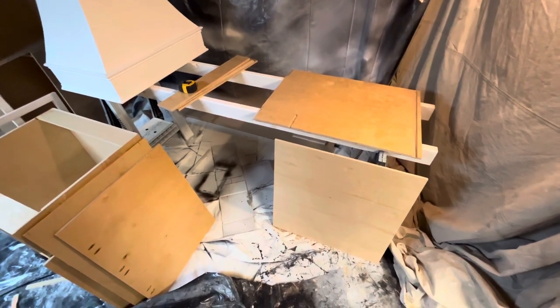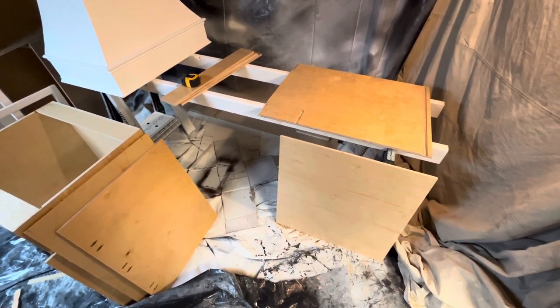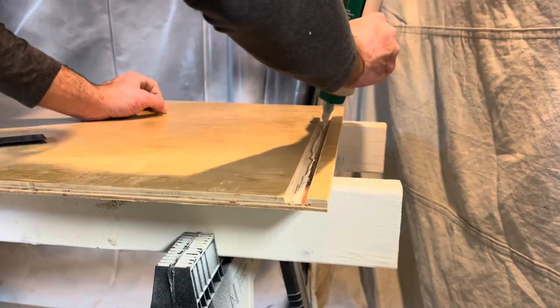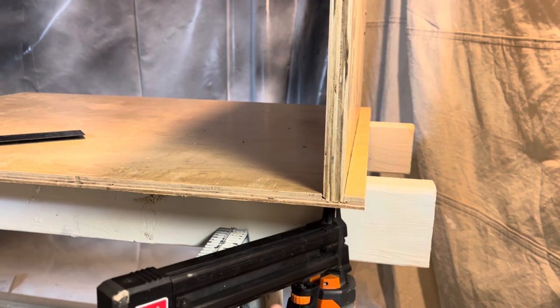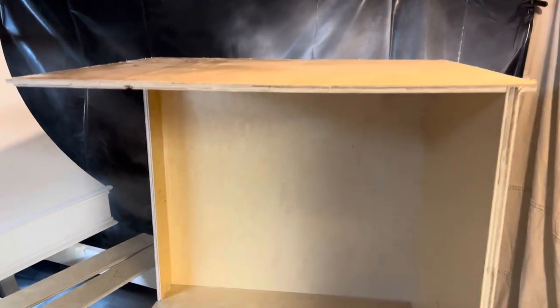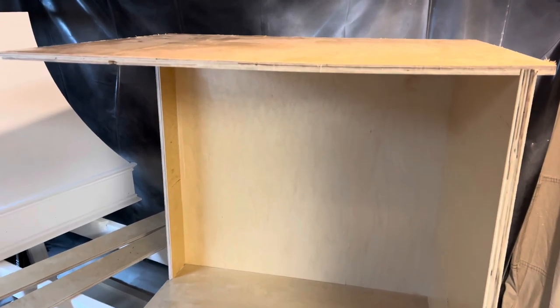Our parts are now cut out and ready to be put together. I'm going to put glue in the dados and nail it together. These are pre-finished plywood, so you can't glue where there isn't a rough surface — that's one of the benefits of the dados. I'll tack it in and tack in the back. Now we glue and put on the top piece. The nice thing with the dados is it makes it kind of like a Lego where everything just clicks together and you know it's square and lined up.